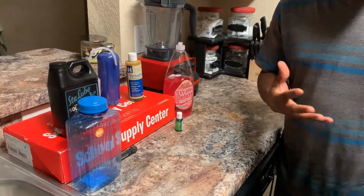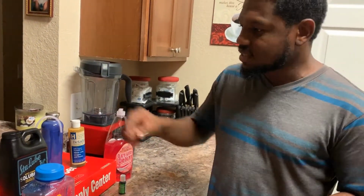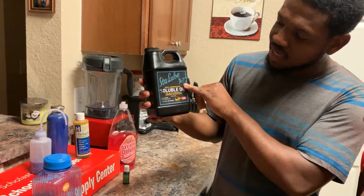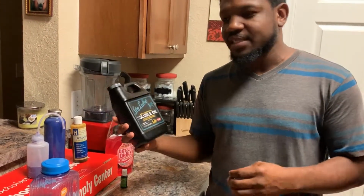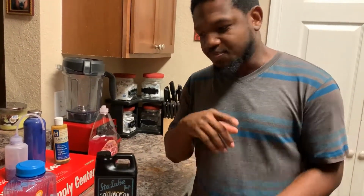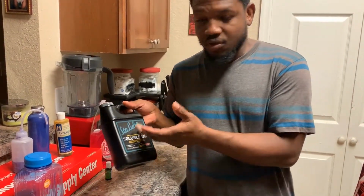If you're going to make this coolant that I kind of mocked up myself, you need a few things. First, the main thing you need is an anti-corrosive soluble oil. It's really meant for metal working and grinding. So it's those oils that turn the water kind of white. It provides lubrication, helps the viscosity of the water, and prevents the metal from heating up and creating friction. But it does turn the water white.